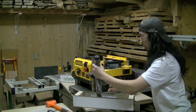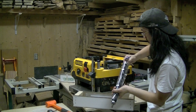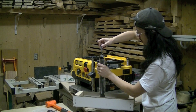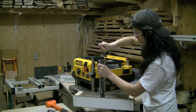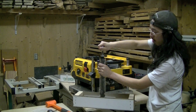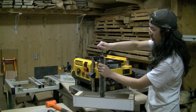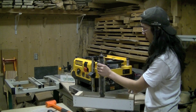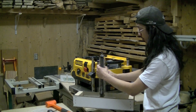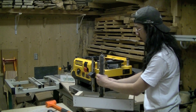The helical gear goes on to the end with the small bearing. There is no hex or any flats on here so I'm just going to go fairly tight. It's worth noting that when I'm turning this way I'm turning against the direction of the cutter so the cutters aren't pushing into my hand. The plastic actually provides a surprising amount of protection — but if you're uncomfortable with that, by all means put on a pair of leather gloves.